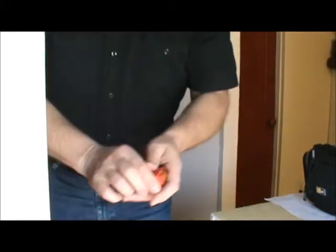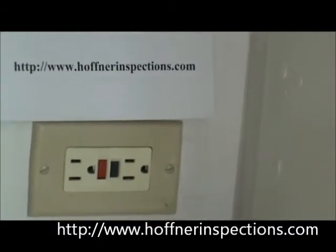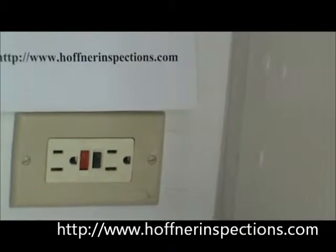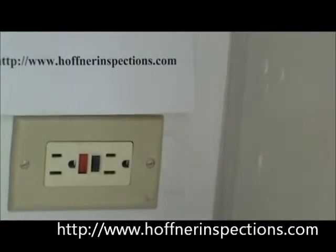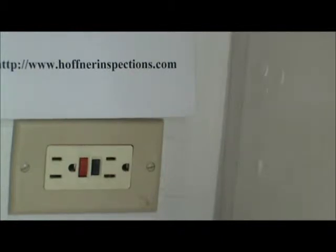Today I'm going to show you how to take a look at a GFCI outlet, make sure it's working properly. And right over here we've got a GFCI outlet, and this is a ground fault circuit interrupter outlet. These are something you'll typically find wherever there's a potential for water. New houses will have them anywhere there's potential for water, which is kitchens, bathrooms, laundries, garages, exterior.